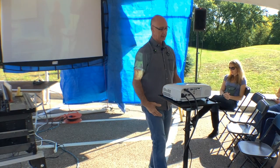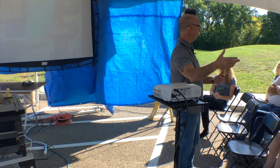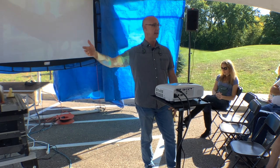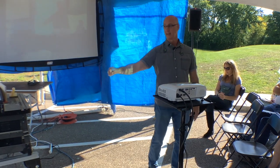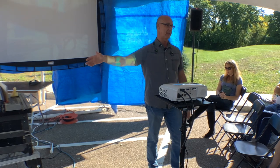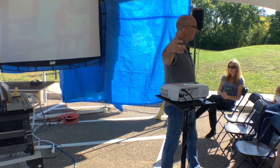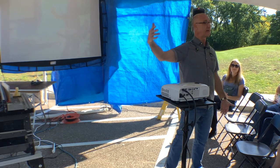So if you're looking to open a cabinet shop and you're going to make raised panel doors all day, every day, you're going to be better off with the induction motor in a shaper. It will be better capable of handling that. That being said, my Porter Cable 7518 three-horse motor has cut 11 billion raised panels in my shop in probably 25 years, and I've never replaced it.